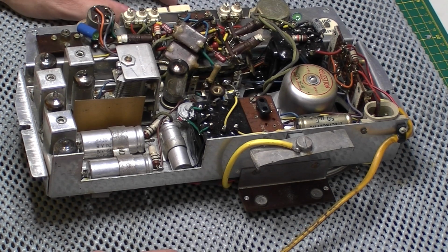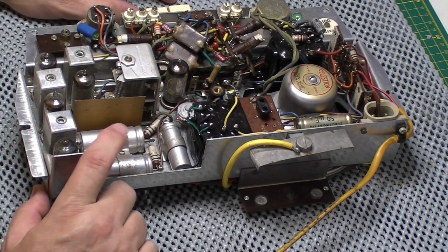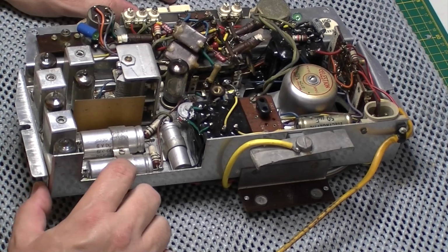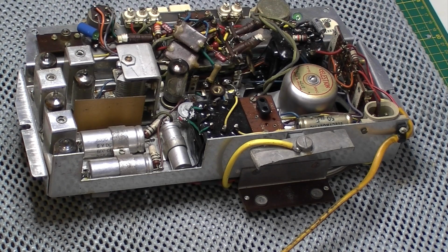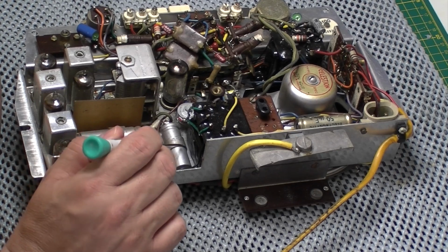I've got some capacitors in now to change these two 3000s. They're extremely high. They might reform, but I've got some that are a fairly good match for that. Also, this one's a 1000 microfarad, again running really high. As it's coming off the selenium rectifier there, I thought rather than mess with trying to reform it, again I haven't got a reformer, I'd have to actually build one.